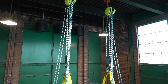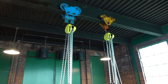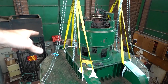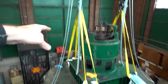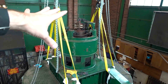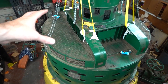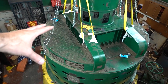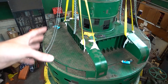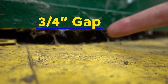Today's adventure involved setting two beautiful brand-new manual chain hoists up there, and we got them hooked to the straps in a double basket configuration for enhanced skookumness. There's four straps, two on each side, double basketed. We are holding a portion of the load of the entire generator at this moment — not all of it — and it doesn't look like we're doing much right now, but we're actually doing a lot in a very tiny space.